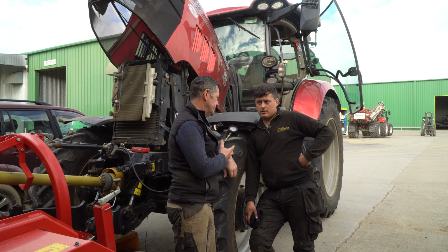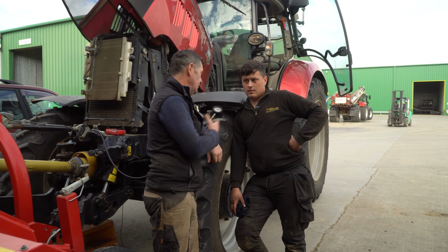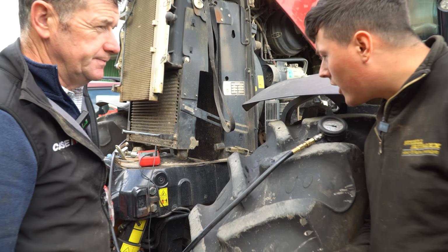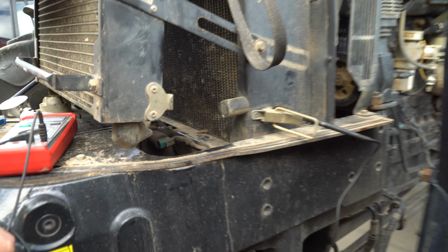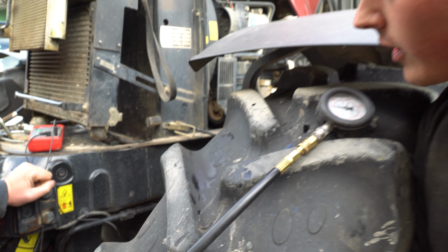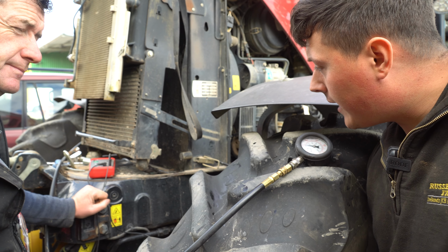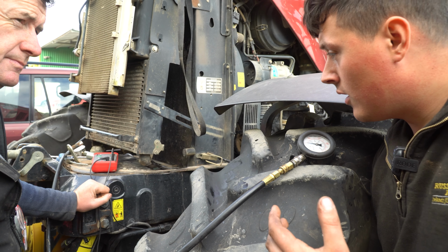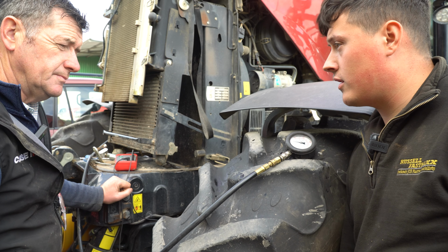So the first thing to look at would be, you said, maybe just check pressures to see, number one, was it engaging? I'm not too sure what the full setup is exactly, but we've a solenoid and oil pressure up here, and it's obviously just moving a piston. If there's friction plates or some sort of dog clutch, I don't know what's exactly inside it. But this morning, once we engage it, I can see the collar sliding in, but it wasn't engaging properly. I was just listening to clatters and bangs, and it wasn't driving the chopper.